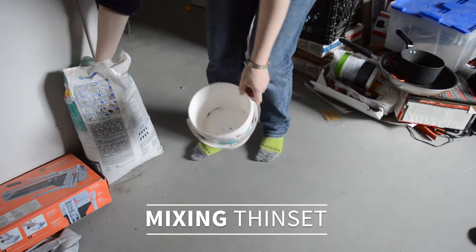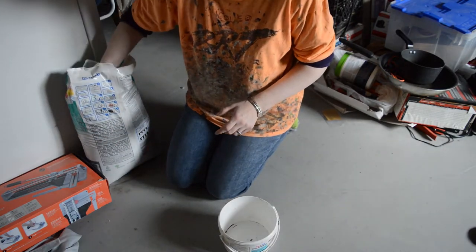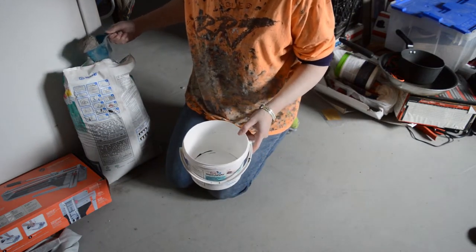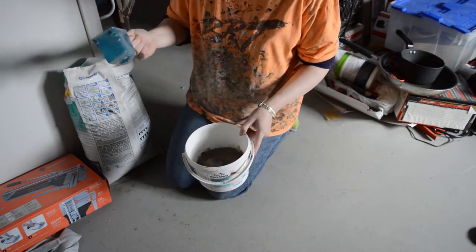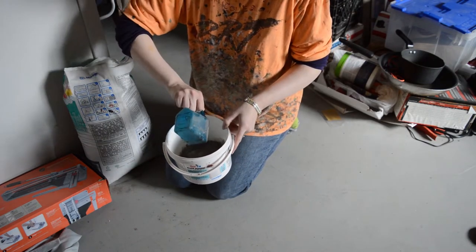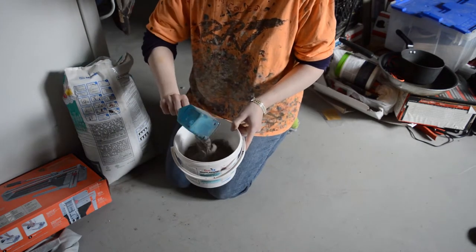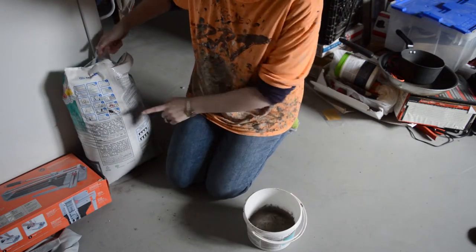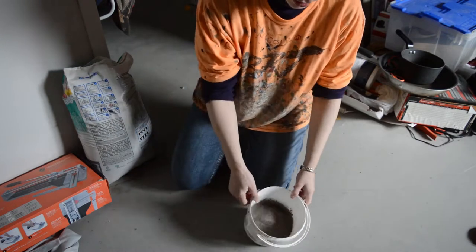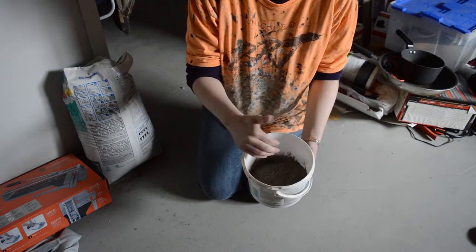I have my mix and I have to go with a quick-set. I don't really like using quick-set — it dries a lot faster — but I'm using a small bucket and only mixing small batches at a time because of that. I scoop it out of the bag using a laundry cup. Whenever you're mixing your thinset, you want to read the bag ratios, but the bags usually tell you to mix the whole bag and I don't want that much. Whatever amount of water you think you need, try a bit less and then you can always add water — it's easier to add water than it is to add mix.